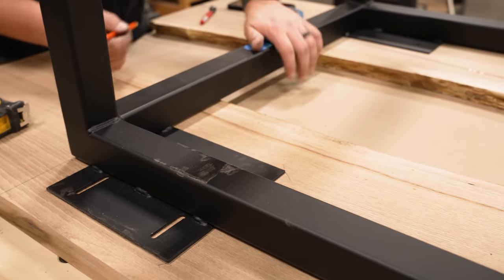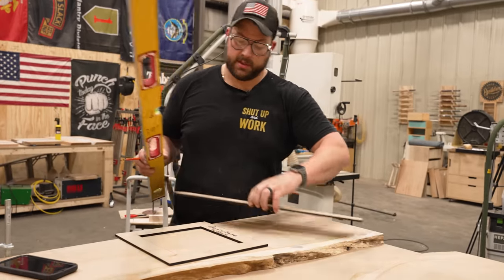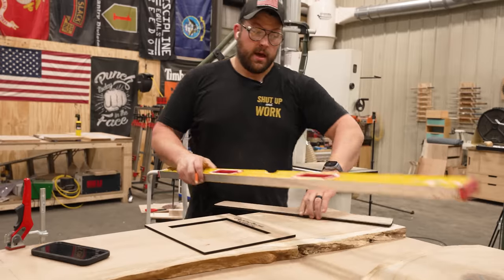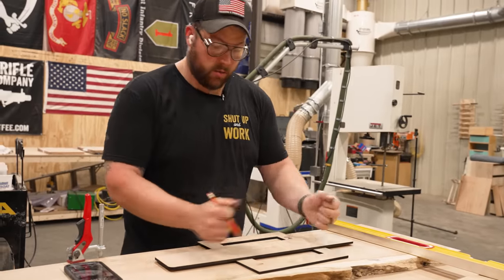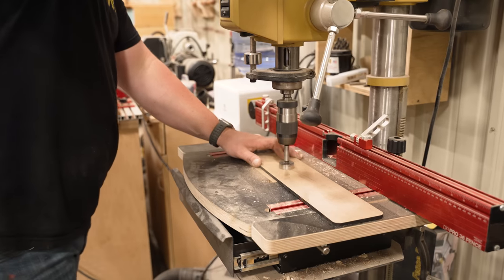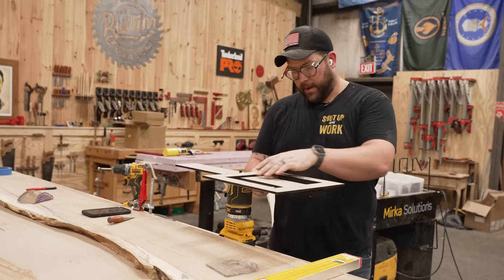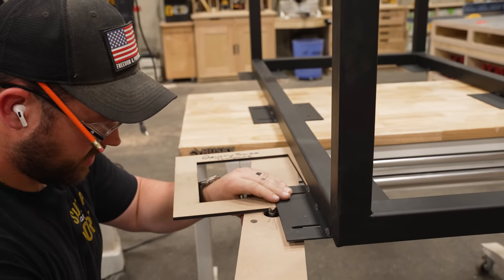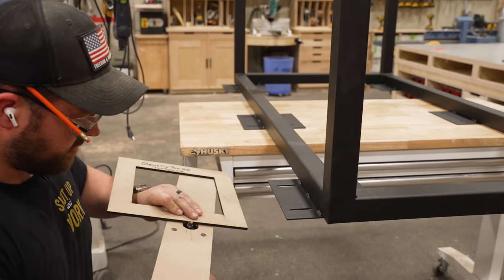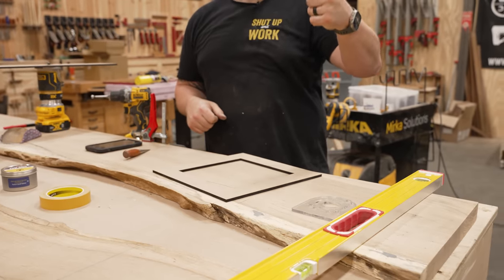It's important to mark what side goes to what, because you know how dumb we all are. To make this cut, I have to suspend the router over the whole template. My big routers don't have a plate this big, so I'm making a big base out of quarter-inch material so I can shimmy the router around on top of the template without it falling in the hole. I'll start from the inside and work my way out. Make sure you measure to the carbide when setting depth — I know this is going to piss off a ton of you, but I can't figure out a better or faster way.